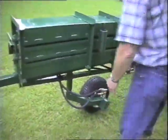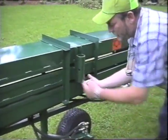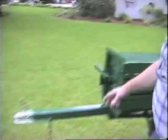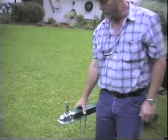When it comes off, you take this wheel attachment and it goes right up in the bottom of this piece of pipe and you put your pin right there and it'll get it up for highway travel. And you just hook this to a 2-inch ball on any kind of vehicle, car, truck, or whatever, and you can pull it highway speed.